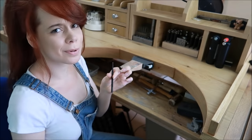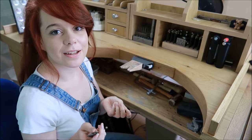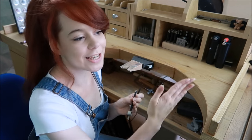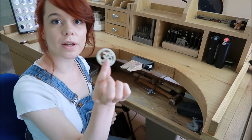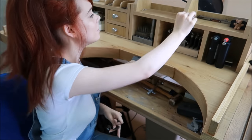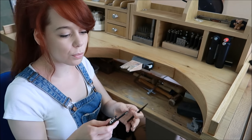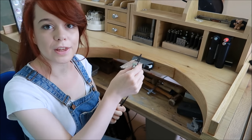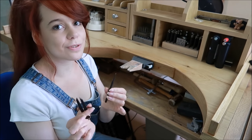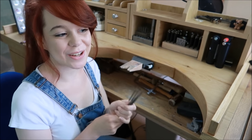A center punch and some dividers — you definitely need these if you're going to be cutting out pieces from the center of things, where you don't want to cut from the outside in. A good example is this pendant I'm working on right now — I have to use my center punch to get in between the bits without breaking the outer circle. The dividers you'll use to make circles or mark out how thick you want a piece of metal for a bezel on a stone setting.